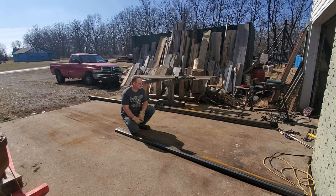And we've got, I think it's seven, six brand new trailer jacks for the sawmill. I kind of want to do four on each side. I do have seven right now, and so I'll have to eventually go buy another one when I can afford it. And then we'll have eight, so we'll be able to do four down each side. That's kind of what we're going to plan for. But for right now, we'll just leave the trailer jacks off of the very back end of it. And we'll space them out like there are going to be four on each side down it.